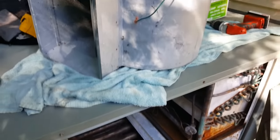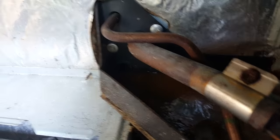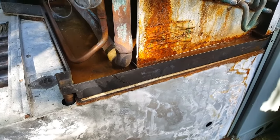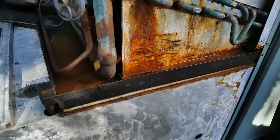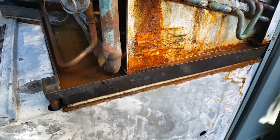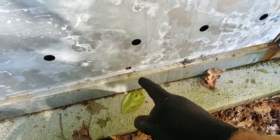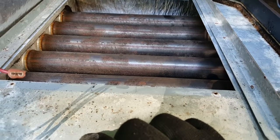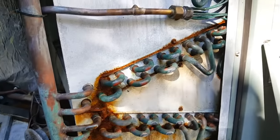Some of these are also used in 115-volt situations. The water is up real high right there — over at the drain it might just be a question of the unit not being level. I may need to jack it up a little bit so it drains better. You can see it running down over here, and some of it might be going through the secondary as well. I can see the heat exchanger — I don't see any cracks in it.